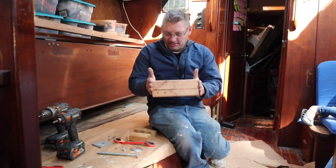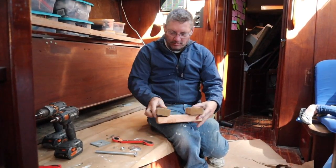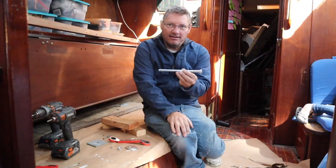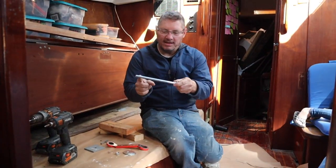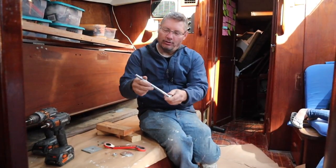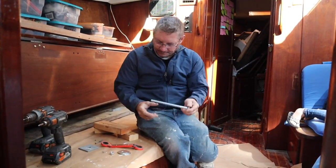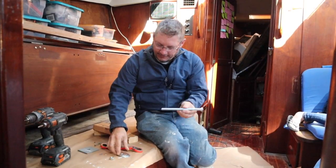What you need: a small chunk of wood, six, seven, eight, nine inches long, and a couple of smaller pieces of two-by-four that we're going to attach on the bottom. I got a half-inch carriage bolt, eight inches long. The reason I got the carriage bolt is because it's threaded much further down — most bolts are only threaded for about an inch and a half, and I want to have all the thread I can possibly have.